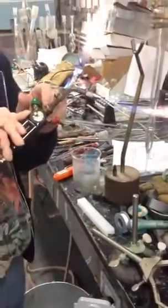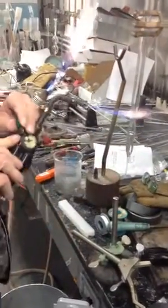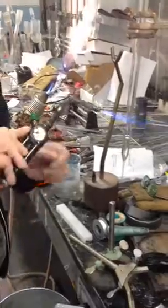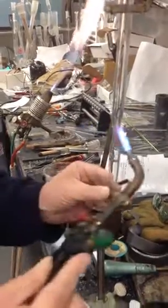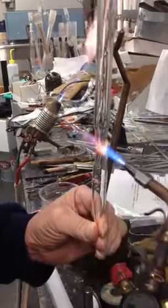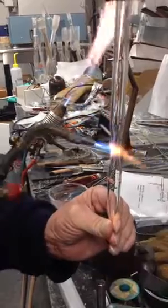This glass is very, very stiff. So you've got to start adding in your oxygen a little bit slow. Keep coming around — you're going to start to get color pretty soon. And when you do, you're going to start to pull. Don't wait, but pull so you can start to taper this. Otherwise it will want to pull the two ends together, and you want to separate. So always start to pull early.